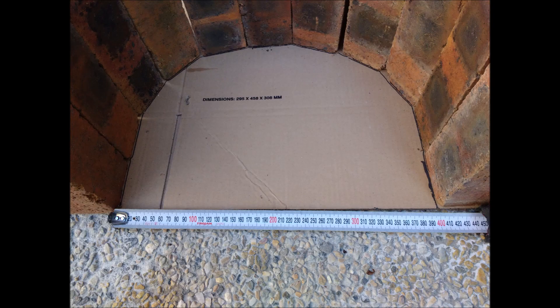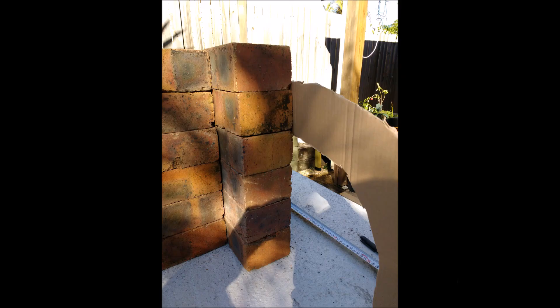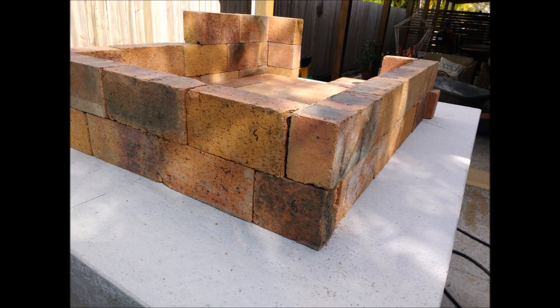That's basically marking out the size of the arch, because I had to cut out a plywood support frame to rest those bricks on while I was putting the arch together. The arch is the only bit that I really mortared in. I used this mortarless design because I wasn't sure if the clay bricks were going to be any good — they're not proper fire bricks, just normal house bricks I got from a friend. I didn't want to spend hours mortaring in beautiful arches just to have the bricks fail. It's turned out they've been pretty good and they've worked well.